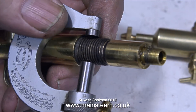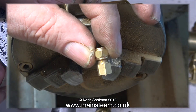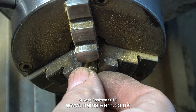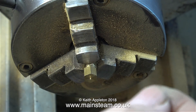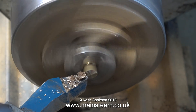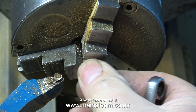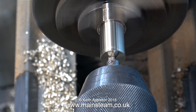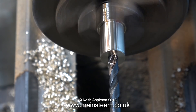This large thread was originally used to connect the steam engine to the boiler, but it doesn't look too good as it isn't currently connecting to the boiler, so I'm going to modify it. I'm screwing a blanking plug into a brass nut and fitting the brass nut into the three-jaw chuck. It's possibly more accurate to hold the blanking plug by the threads, but you can't tighten them up very much in a chuck, so I'm running the risk of this not being 100% dimensionally accurate. This is not a precision part — it's just a blanking plug. To profile this I'm using my specially shaped round nose tool, which I grind to shape to suit certain jobs. I bought this tool from Black Gates Engineering and it was very cheap because it cuts to the right not to the left — all I do is change the position of my tool post.